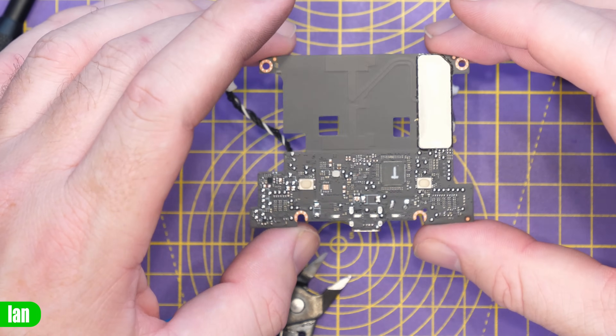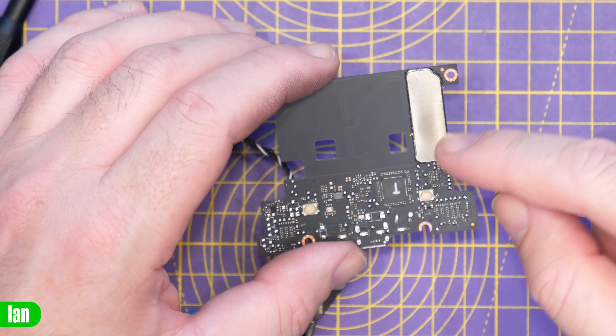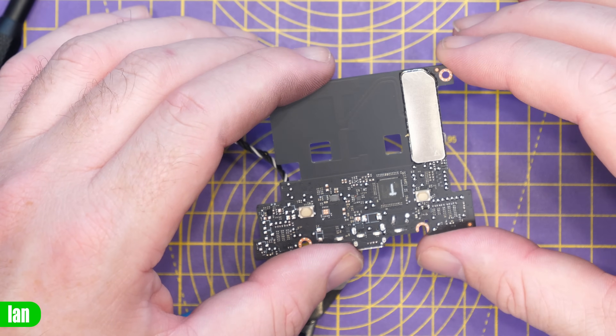What's interesting is you've got vertical polarisation and horizontal polarisation — they've got the two polarisations matched. The antennas don't actually look the same; they look a little bit different, interestingly. These ones over here go through the traces through to the board and the RF chipset, so there are definitely two of them. Overall, rather interesting. I think we'll get this lid off and then get it under the microscope.